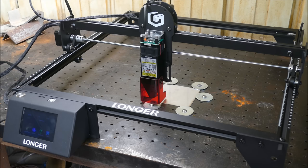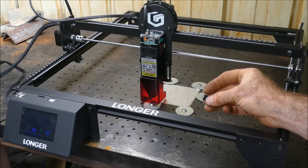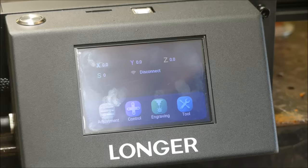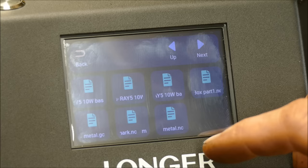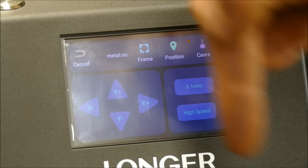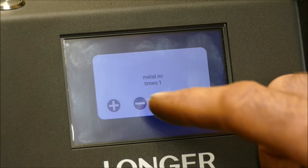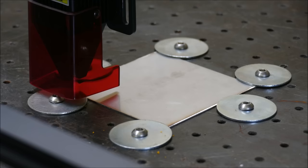The first test I want to do is engrave some stainless steel — we're metal workers, that's what we're doing on this channel. I've got it fixed to my jig table here to make sure everything is flat, because it will warp when being engraved, so having it secured down is a must. I've created a special file on the micro SD and slotted that in. Here's the opening menu — I click on engraving, select the file, and then click frame, which draws a little outline around the area so I know it's hitting in the right place.